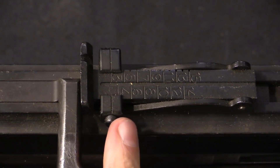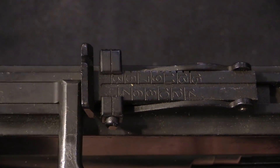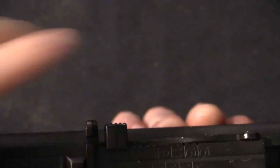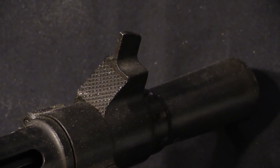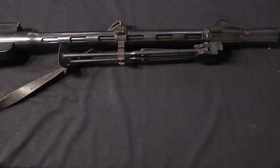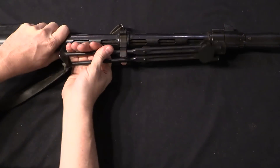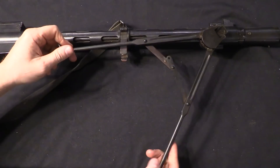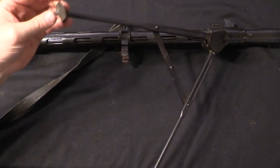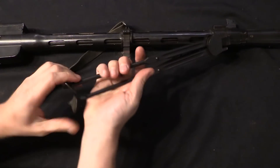The rear sight — actually both sights — are offset slightly to the left. It's not entirely clear to me why, because the magazine is on the bottom and doesn't get in the way. It is a U-notch style of sight, similar to what the Finns were using on their Mosin-Nagants. The front sight is a nice big square post, also slightly offset to the left to match the rear sight. We have a rather spindly, loose bipod — fairly similar to a French Châtellerault 1924/29 bipod — there is quite a lot of movement in it, but it does work.